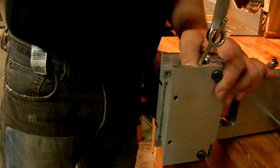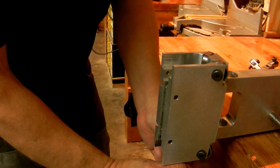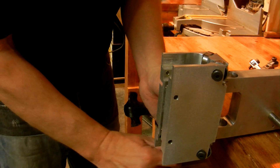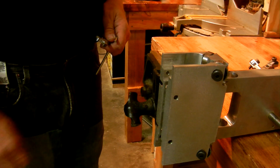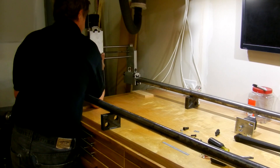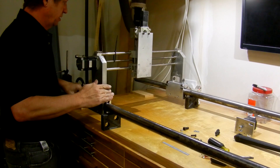The old shaft datum line was here and the new one's here — there are a couple more inches on the z. It was a little tight before; the other one was great for a router but didn't work so well when you got into anything of any depth. So this will have a little more z-travel now. It's ready for the load — let's see if we can get this x-axis on here. There it goes. Excellent.